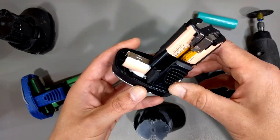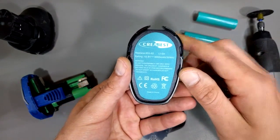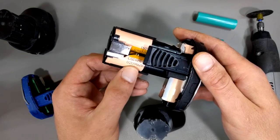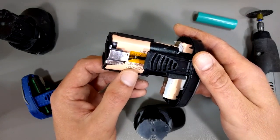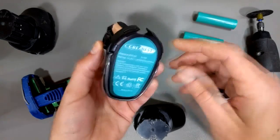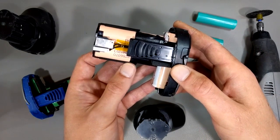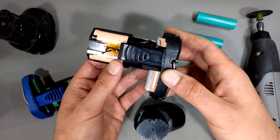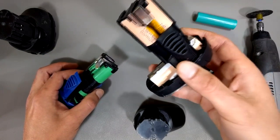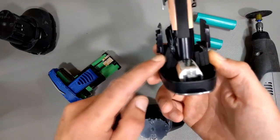No name aftermarket — but look at this sucker. The cells are actually LG cells, and it says 3 amp hours. It's actually not, because if you look at these cells the numbers on here give you the current rating — something like 2100, so 2.1 amp hours, which is obviously not 3000. I bought this on Amazon France and wrote a review saying it's not 3 amp hours but it is 2.1. That's still a lot higher than the 1.3 amp hours of the official Dremel battery, giving you about 50% more battery life. And it's one third the price and extremely robust.